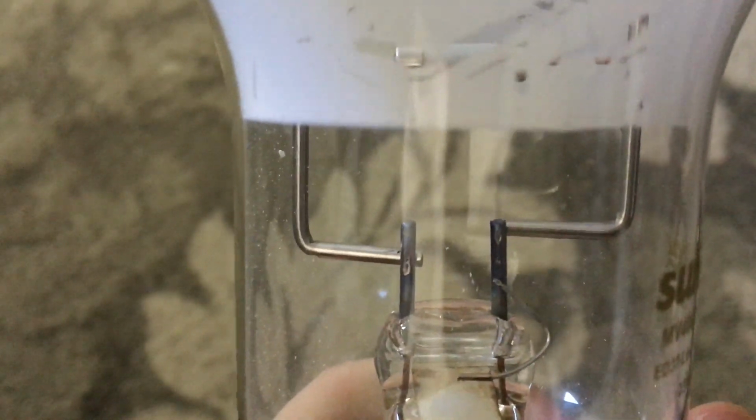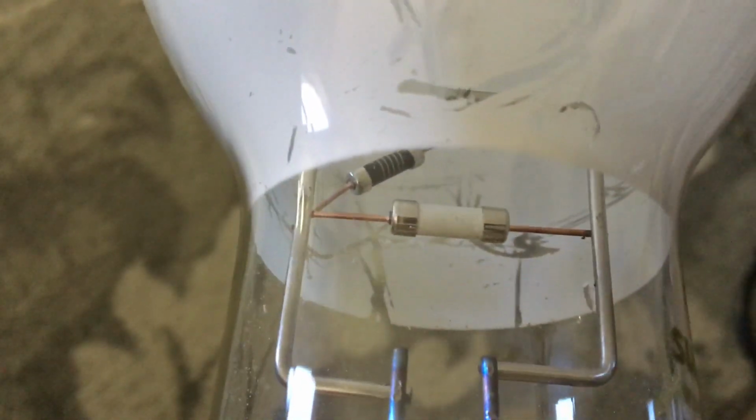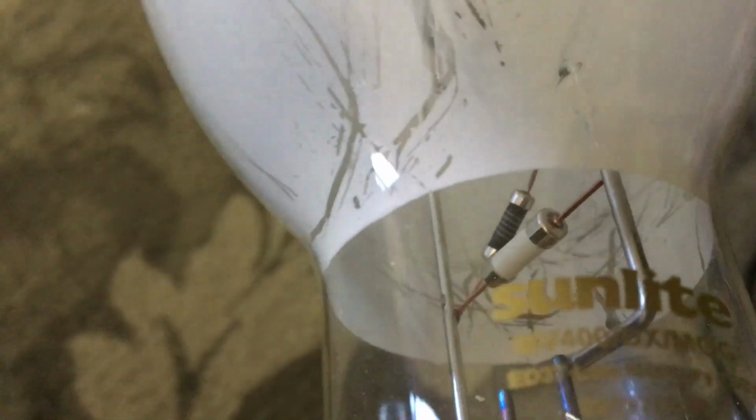You can see some lead wires which were welded. You can see the welding process to connect to the arc tube. We do have the dimple for extra support for the whole arc tube. So that's what I mean by that. I'm not sure what that is. Pretty sure it's like some type of cutoff resistor or something. Here's the probe start resistor right there.